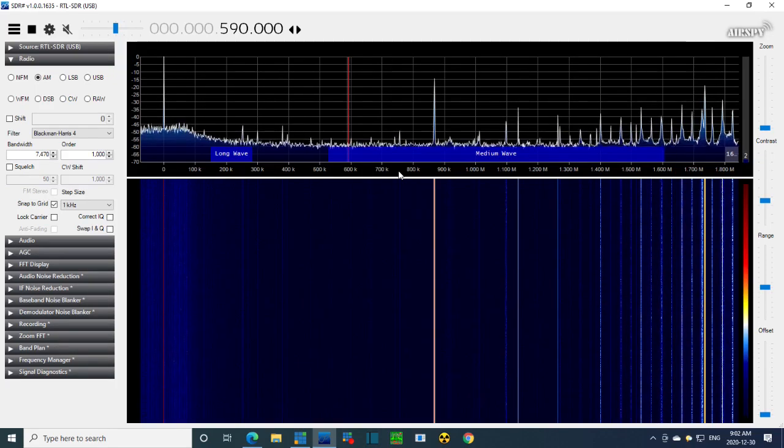So the radio is listening to, how do I know for sure it's listening to that signal generator? Oh, I gotta change the modulation frequency for a moment. Double check and make sure we're listening to the signal generator. Yep, no doubt about it. Very quiet, but it's there. I could do an alignment. So probably, I don't know, I don't care. Stay focused, Jim. Stay on track here. So we're looking at what's happening in the IF. I'm gonna tune the actual radio. Change the local oscillator frequency a little bit. You can watch right around the 75 kilohertz area on the far left there.